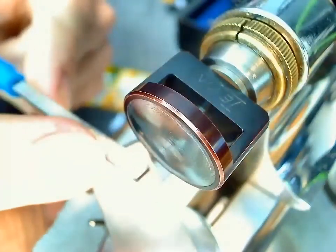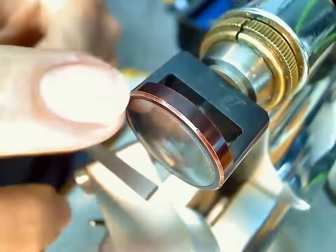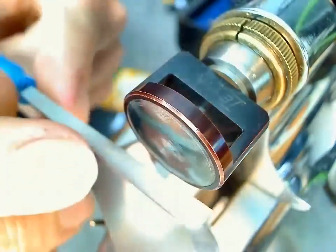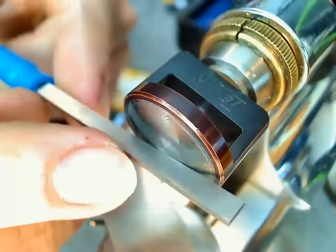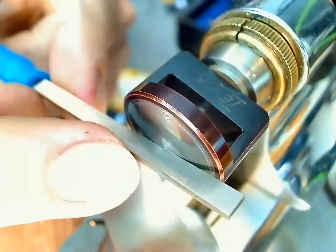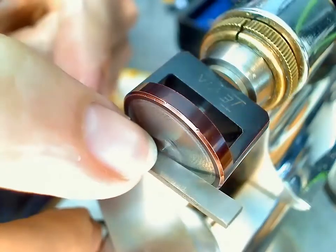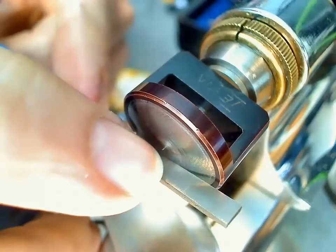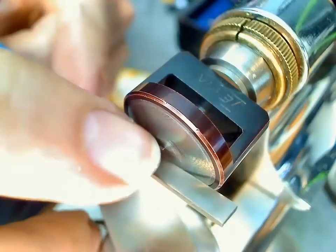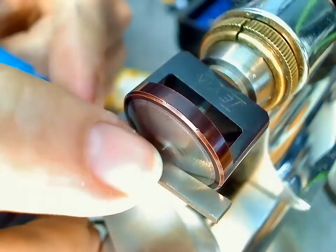So I noticed that there's a bit of a dome on the balloon chuck, and the dome is there, so as you can see when you align the burnisher against it like this, you're pretty much only getting the surface of this dome, the top of the dome hitting the burnisher. So it's not fighting against the surface here. You get pretty good contact with that.